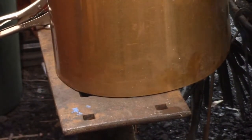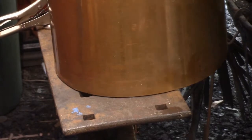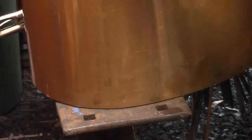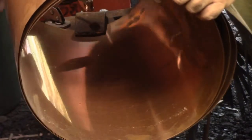This has something to do with roofing copper. I didn't know if it was partially annealed or fully annealed, so I did throw it on the forge and then quenched it. It picked up a nice oxide color, which later worked to its advantage and gave it a nice fall color on all the leaves.